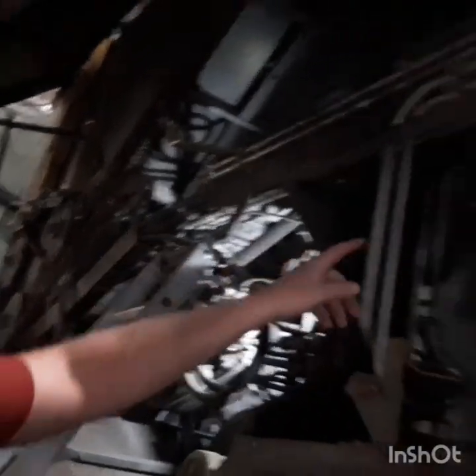So the combine is here, letting it warm up overnight and thaw while we're here. We found that I haven't been using the chaff spreader because when we were doing our inspection, just playing with the machine, we found that the little pump was bad up here. They had a broken hose — just a little bleed line was broke back here. So I ordered that hose. The hose came in, I plugged the system in, go to turn it on and it won't turn on. I called back to Ziegler and they said check that pump — that belt sometimes breaks. I said well that pump sounds kind of growly when you turn it over by hand; it doesn't sound pretty at all.